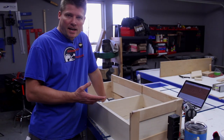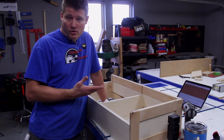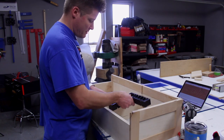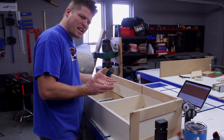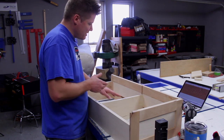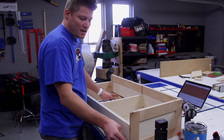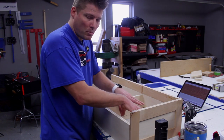All right, before I do some final sanding and put all this together, I've done a dry fit to see what it looks like and if everything lines up and all the joinery joins up without a problem. I've squared up everything with some square blocks, put it inside the corner there. This is also square right here, and lines up perfectly with each other. This looks kind of strange right now because the plywood that you see right here is actually going to be lifted and be flush with the top so the main platform can fit inside the dado that we made here. I've also got another adjoining one that's a stop dado that stops just past the face frame on this panel that will go all the way up underneath. That way it'll complete the bottom of this while leaving an opening for the faucet head.